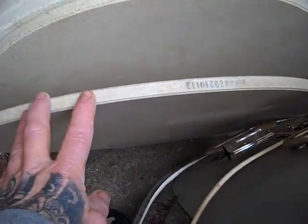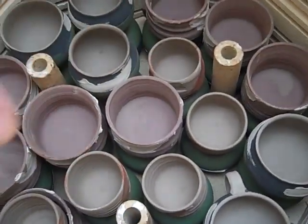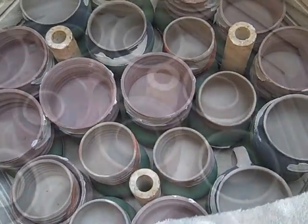I've put the props in from the edge. I'll try and do that because it evens the load on these shelves — they're not really thick, at about 16-17mm thick. So if I bring the props in a little bit and stack above them, it evens the weight distribution on the shelf.